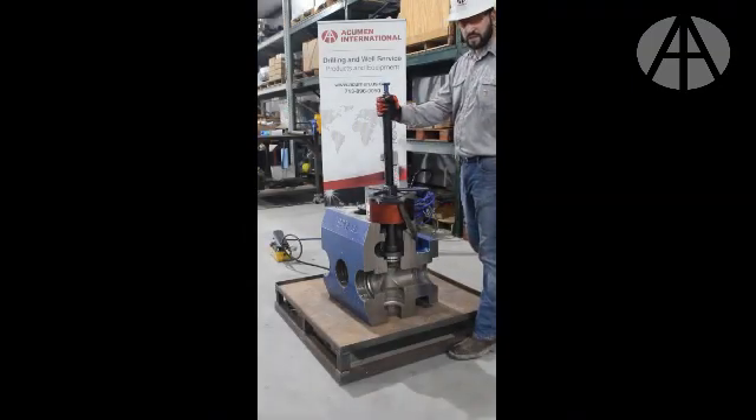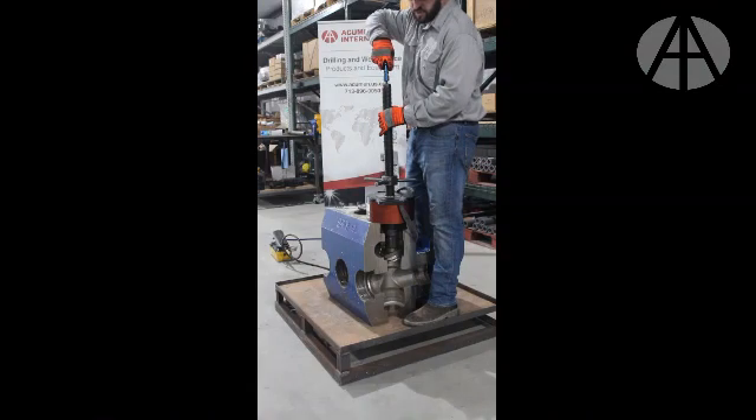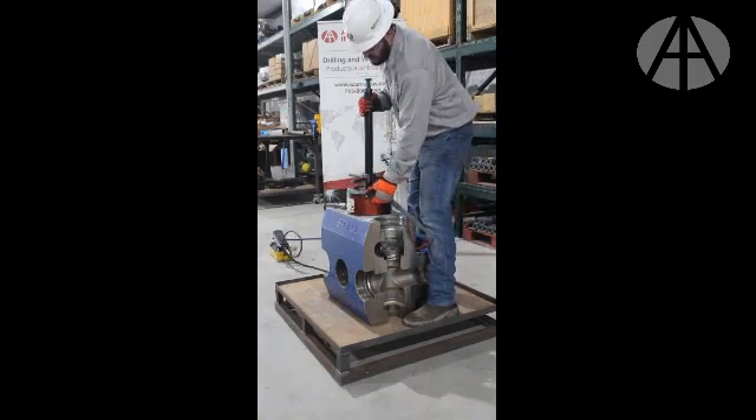Once you make sure the seat is loose, you lift up on the puller, you release the valve seat in the fluid end, you re-engage the pull knob in the lock position, lift up on it, and engage the next seat.